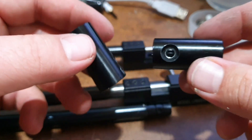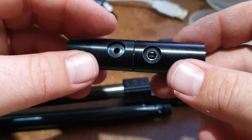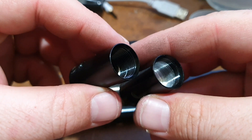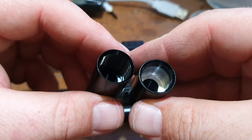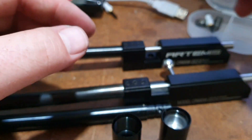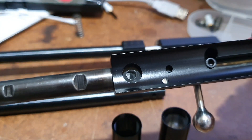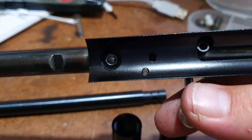At the other end, obviously a larger transfer port hole — the standard one is 3.5 millimeters whereas in the 25 cal I've gone for five millimeters. I've also opened it up, removed some of the threads that aren't really needed since I've shortened the thread on the other piece, and seated it down a little bit deeper just to give a little bit more valve volume. I also increased the diameter of the hole through the transfer port and through both the breech and the barrel, and obviously the new flow-through port's got a hole the same size in it too.